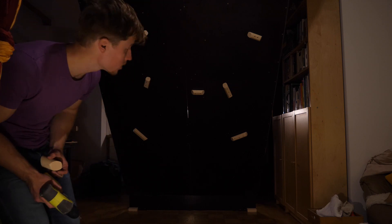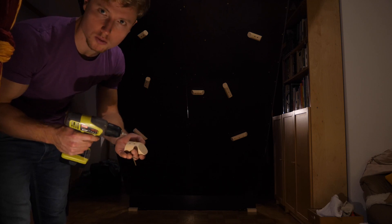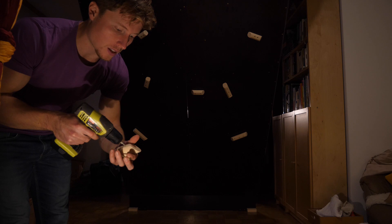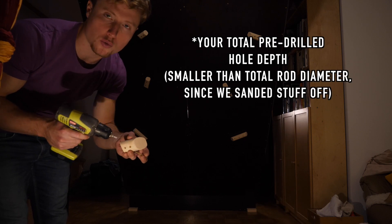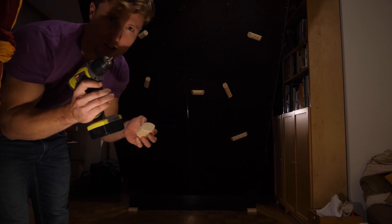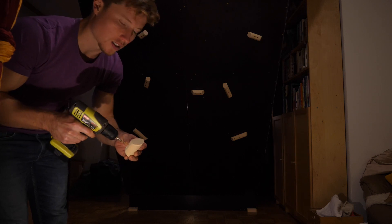Because they are so round — because it was a pole — you have to hold them kind of actively. The more you can get your weight towards your fingertips, the better. Look at those beauties, looking epic! One thing I already noticed is that you have to be careful with the bigger pre-drilling for the screw-on heads. If you get them too deep, the hold is not supported ideally. You want to get them to around two-thirds of your total diameter — which here is four centimeters. If you go too deep, you'll have so much leverage on the hold that you can actually move it slightly, and that's what you want to avoid. So don't go too deep on your bigger pre-drills — a little tip there.